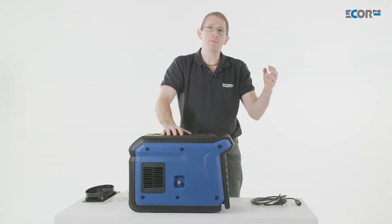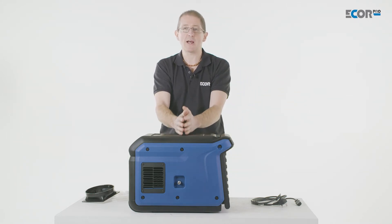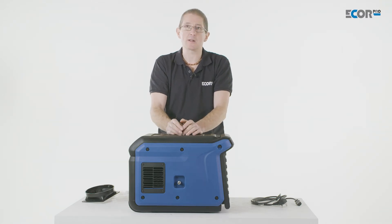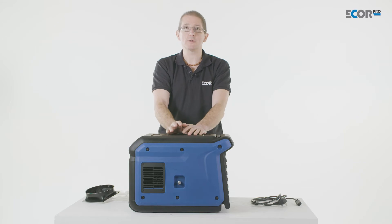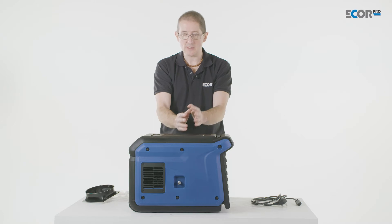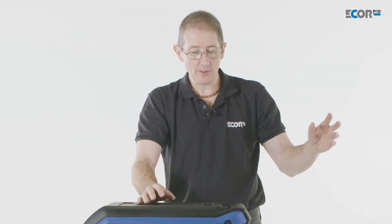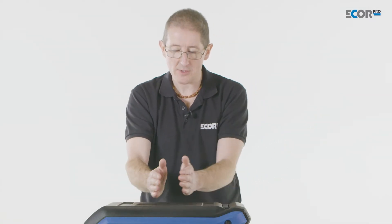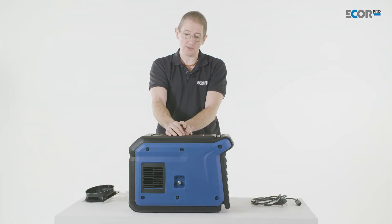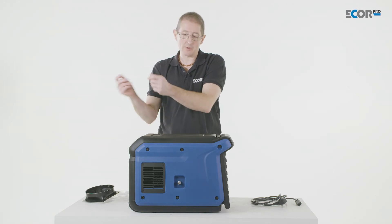How they work is quite simple. The wet air from the building we're trying to dry is taken into the machine and the air is cooled down. Inside this machine there are cold surfaces, which you could liken to a lager glass standing on the bar or a milk bottle that you've just taken from the fridge. When we see water droplets gathering on those cold surfaces, this is because cold air cannot carry moisture. So it's taking the humid air from our wet environment, cooling it down on a cold coil, water droplets gather there as condensation, and then we end up with dry air continuing through — and it's that dry air that we use to dry our building.